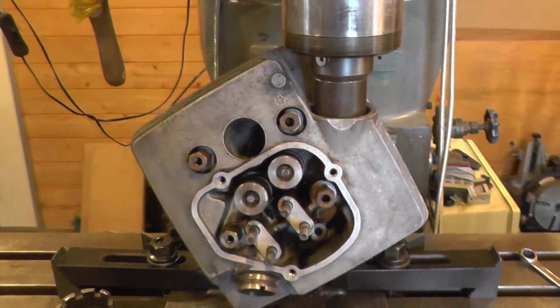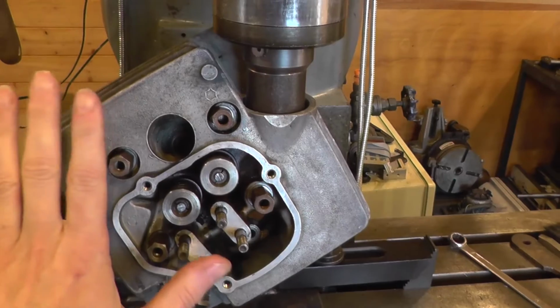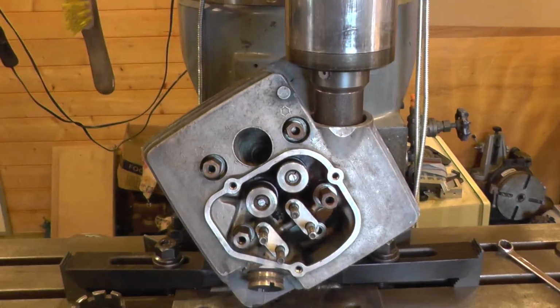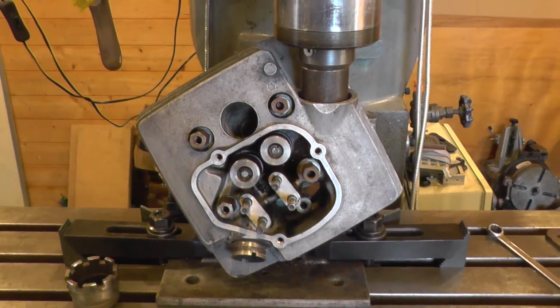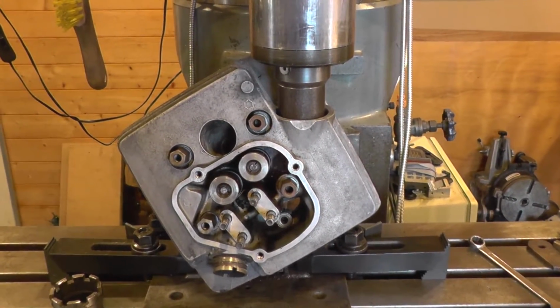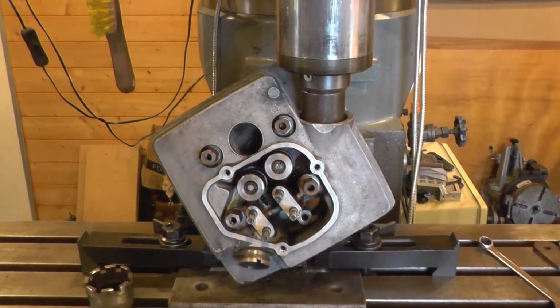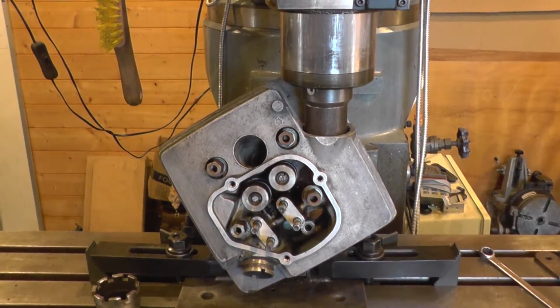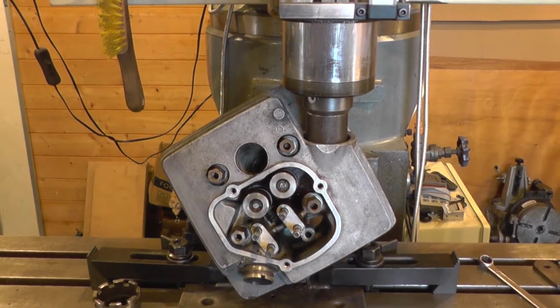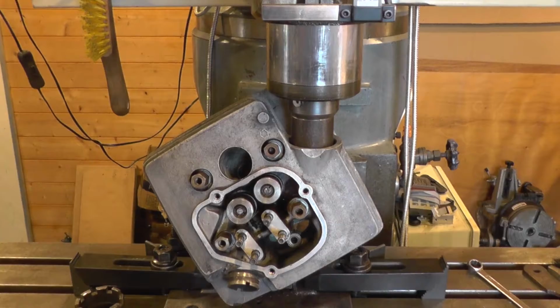For the rear angle, we've got the adjustable straps. For the front angle, there's a little bit of slop on the stud, so I've just clocked the angle, and now that I'm happy with that, I'll tighten these sleeve nuts that I made, and we'll lock it into position, and then the next job will be to centre up as best we can on what remains of that bore.